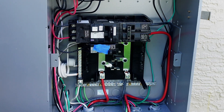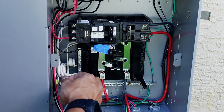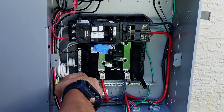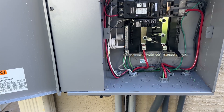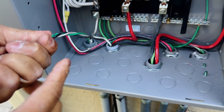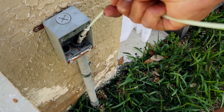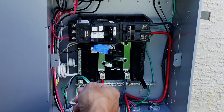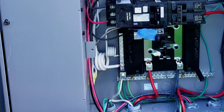If you're running a new circuit, you're going to have to run new wires. As you can see in my breaker box, the wires are already ran. In order to do this, all I did was run a fish wire through here, and I was able to pull my cables back with my fish wire all the way back to the outlet I'm running. So once you have your new wires in the box, the next thing you want to do is terminate them.